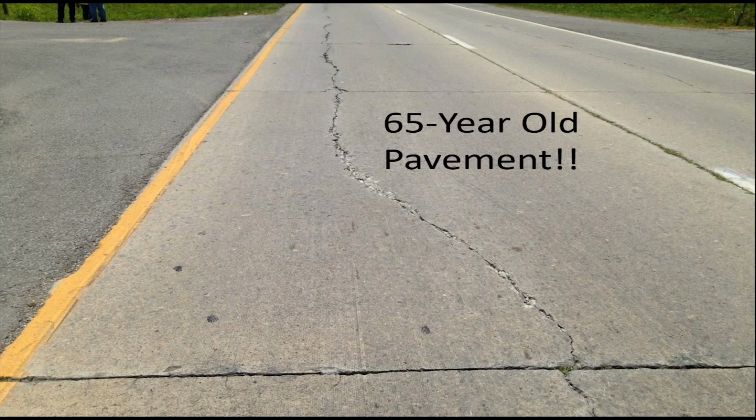So by taking that into account and also considering the traffic, I think this was a US route that ran parallel to a newer interstate route. And when the interstate route opened, it basically siphoned off the traffic off this US route. So it kind of settled into old age as a lesser used road. So again, truck traffic was not a major concern here. Rather than going in and doing wholesale replacements, at the most, maybe do some cross stitching, maybe a little crack sealing or crack filling along there. That's probably all you need to do.